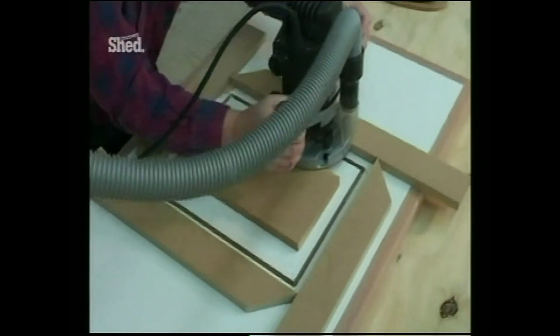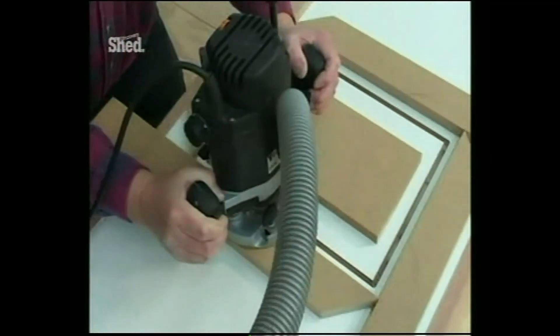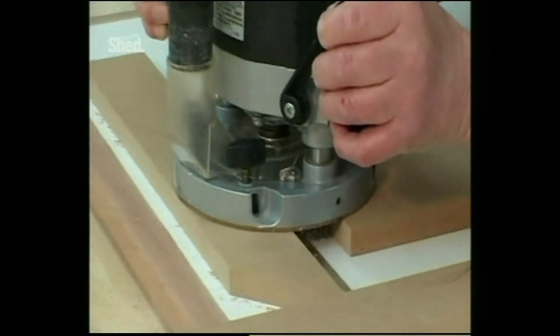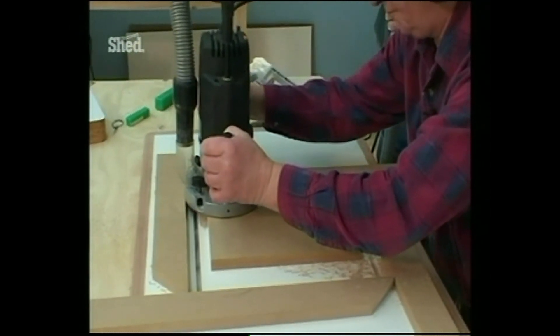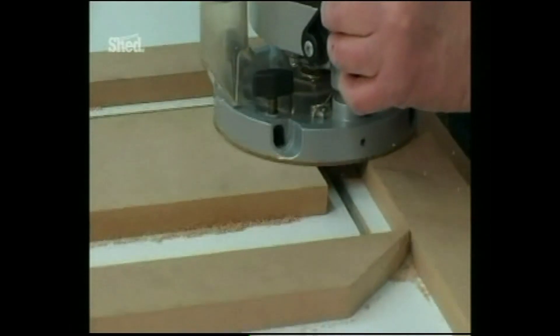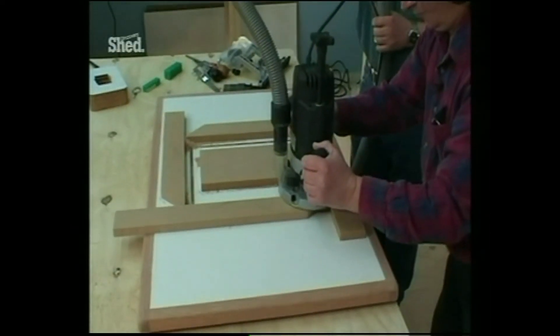I noticed you were going in a clockwise direction — is there an important element to that? That cutter, as we look down on it, is rotating in a clockwise direction. So as we come up here, we are going against the resistance of the cutter that wants to come back to us, and at the same time the rotation force is holding it in. And it's one of the golden rules of routing: clockwise around the inside of a figure, anti-clockwise around the outside. That's a really good tip — and that preserves the correct direction of cut from first principles.